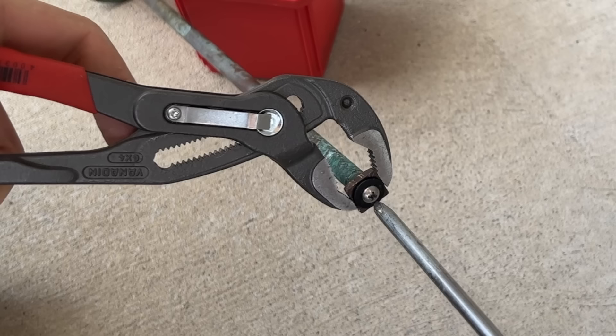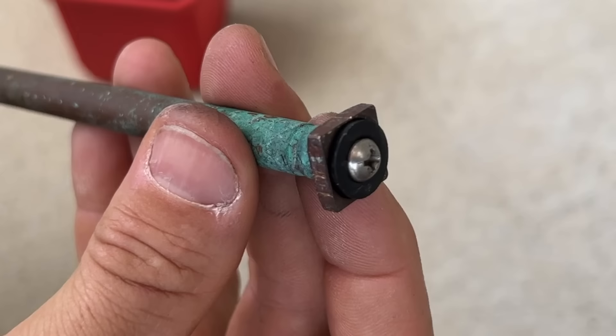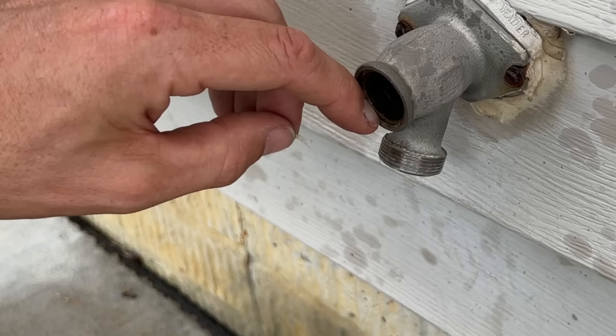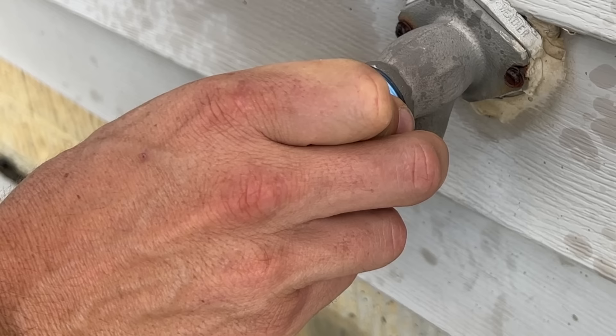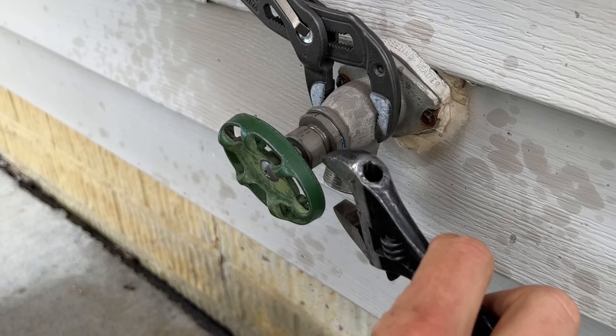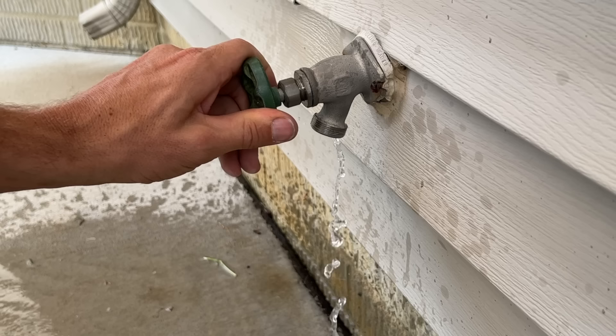You do not have to over-tighten this, but just make sure it securely holds the flat washer in place. Let's reinstall and see if that fixes our issue. Clean out the threads and make sure you don't have any debris. I had a small plastic washer on the surface but don't have a replacement, so I placed a little Teflon tape on those threads — not expecting them to leak, but that will help us avoid any issues. Then using our crescent wrench and holding the valve body, we'll tighten everything down. With the water back on, we'll go ahead and turn things on and see if we can stop that dripping.